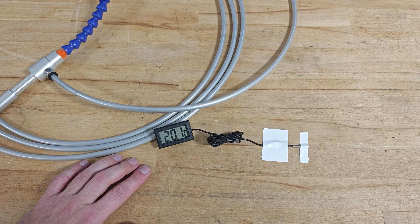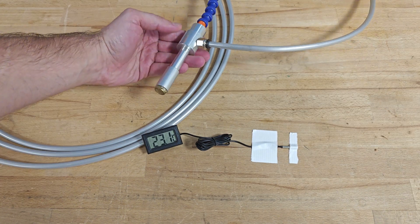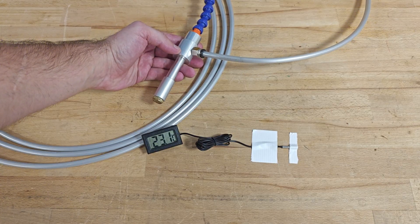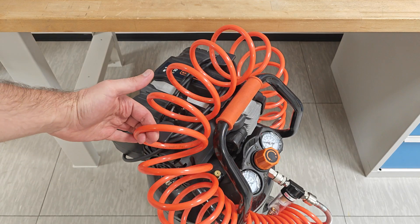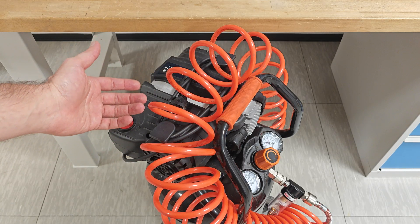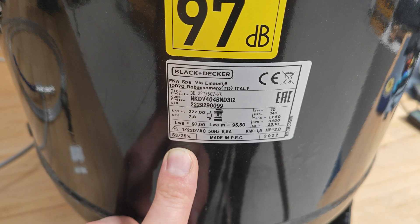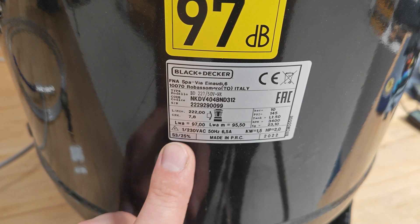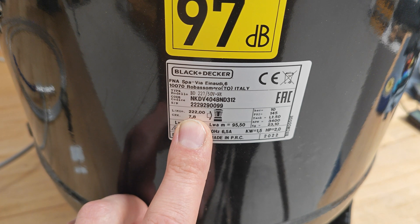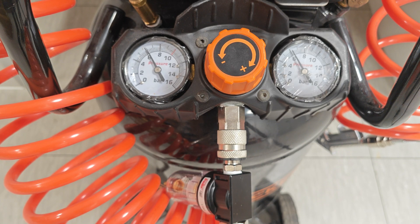About 19 degrees — way above the minus 6 we were getting with the vortex tube. I think I proved my point. Now a few words before closing this video: the compressor I'm using is an ordinary household compressor and it's not exactly the machine I need to fully demonstrate the capabilities of the vortex tube. While being able to deliver the required airflow of 220 liters per minute, it's not able to sustain the needed pressure — the pressure drops really quickly and this highly affects the cooling capabilities.